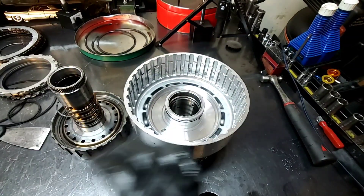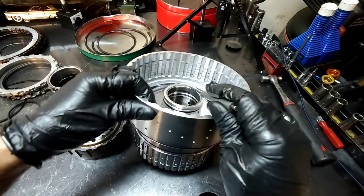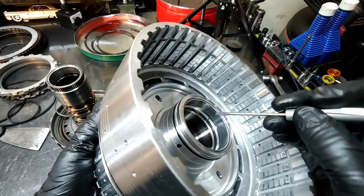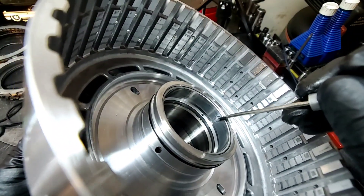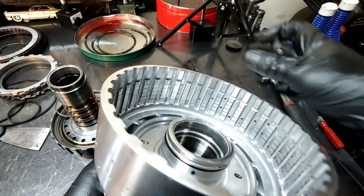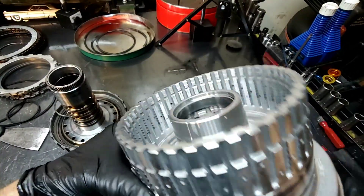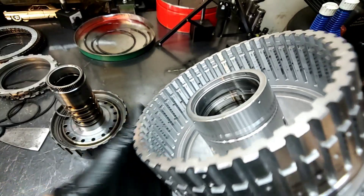The sleeve moves down, and what I believe is going on is that these bushings are wearing out. You can see right here where the bushing meets together — you can see a little bit of unworn area right here, but then it's worn all the way around. It has a little bit of oil still; I tried to clean it the best I could just to show it on camera. This bushing here is also worn all the way around.